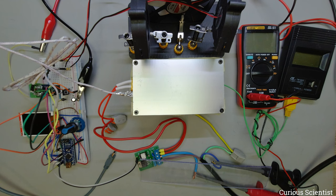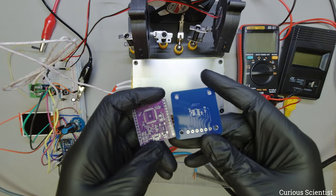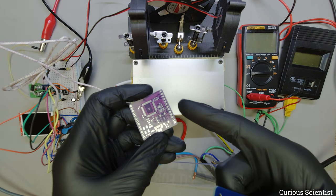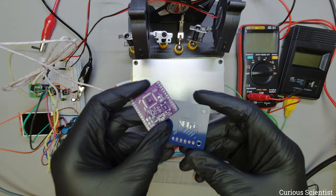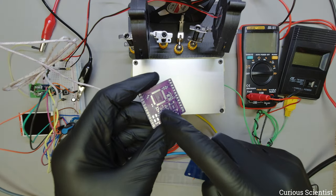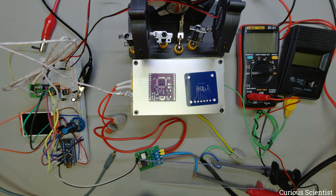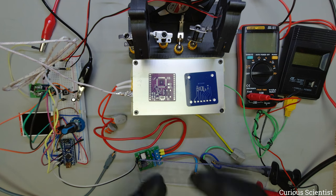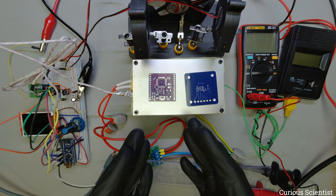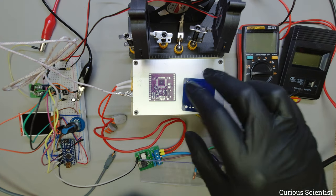What we want to do here is we can start with some boards — these kind of PCBs. These PCBs have very tiny components and they need a different kind of soldering other than just using a soldering iron. Of course if you are good enough you can do it by hand, but maybe not for this board. So what you want to do is put these boards on a hot surface whose temperature is regulated, then make a preheat and soak the board, then go up to the reflow temperature, and finally cool down the board so the liquid metal will solidify and the solder joints will create a solid galvanic connection between the pads and the component legs. That's the purpose of this device.